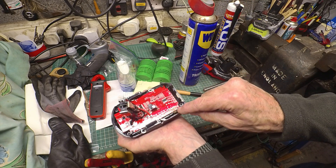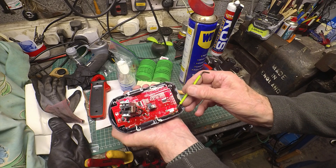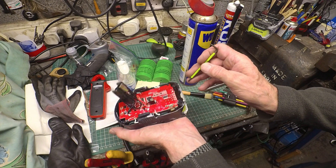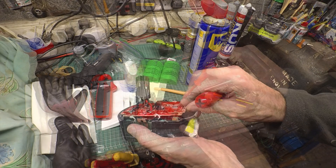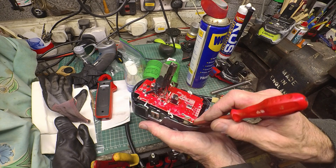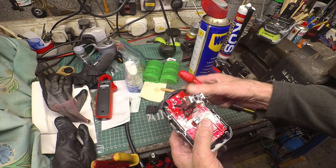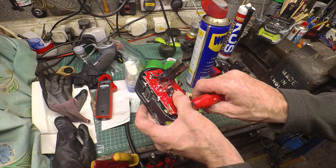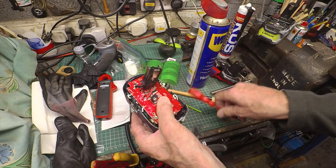It doesn't just lift out — there's a missing screw here, and two screws are missing altogether, so they've obviously saved a bit of money by only using two screws to attach the board. The board is held on with the straps that connect down to the battery pack, so it won't come off without desoldering those straps. I'll stick these screws back in. These straps are quite discoloured and have some kind of coating on them which they shouldn't have — whatever this got sprayed with or dropped in.